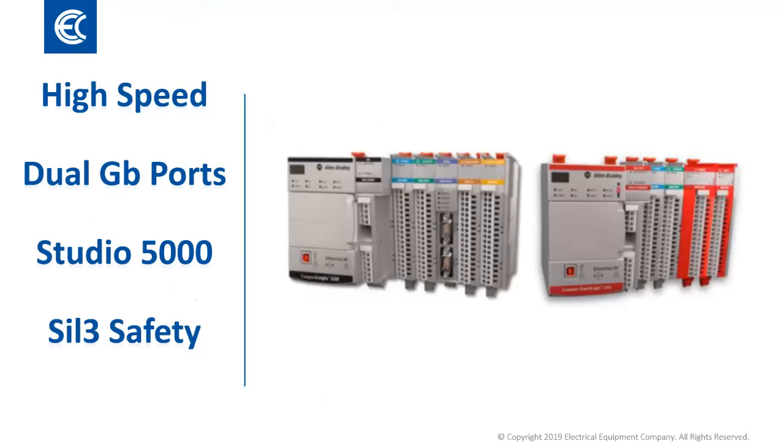In order to use the SLC to CompactLogix conversion kit, we need to migrate to Rockwell's high-performance 5380 series control platform. By doing so, we get several performance benefits. These include high-speed data transfer over the backplane and dual gigabit Ethernet ports for DLR and linear applications. Programming will be done in Studio 5000, and you can achieve up to a SIL3 safety rating with Compact GuardLogix safety systems.